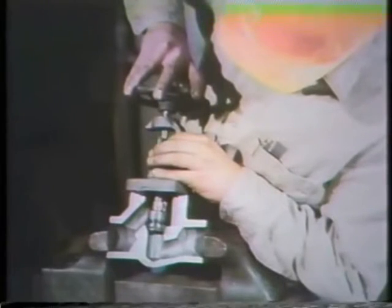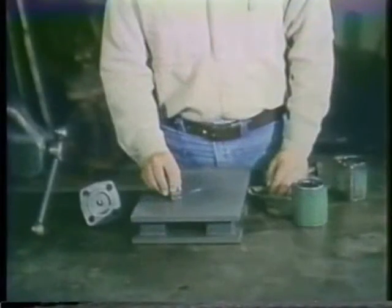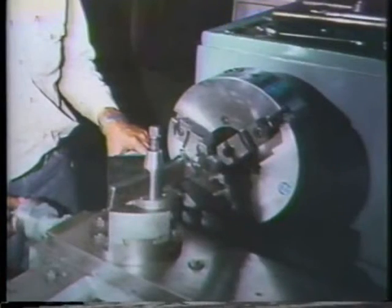Let's go over the lapping and grinding in processes again briefly. When the disc is rotated against the valve seat, it is called grinding in. And when the disc is rotated against another surface, the block, it is called lapping. Both processes use lapping compound. Lathes and reseating machines can be used to resurface a valve seat or disc. A lathe is generally preferable to a reseating machine, especially when repairing very hard metals such as stellite. This is because it takes less time to use a lathe and the cutting can be controlled better.